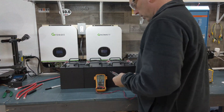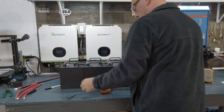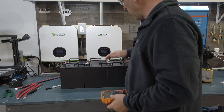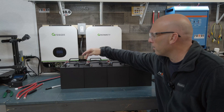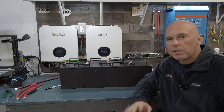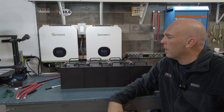All right, we now have them in a series configuration. If we take our multimeter and touch the terminals — positive and negative — we can see we're reading 53.27 volts. That's right about where we want to be, so we know we're connected up properly. We're going from positive to negative, positive to negative, positive to negative, positive to negative. Then from our inverter, we connect the positive here and the negative here and everything should be working as expected. We're going to do that in the next video — video number four — where we'll talk about wire sizing first, some code stuff, and then actually hook them up.